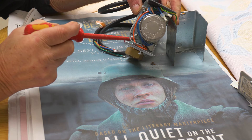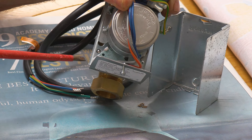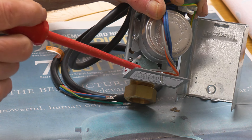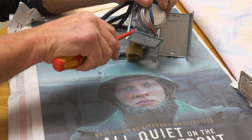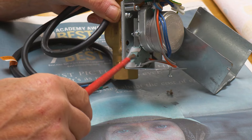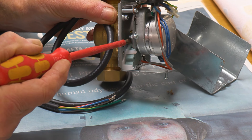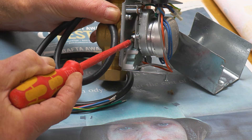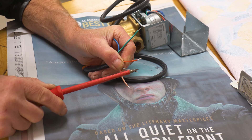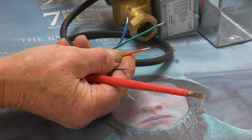I had a look at a new motorized valve and I've never really noticed this before, but they've put a very substantial plastic body around the micro switch housing, which gives it much better insulation. The terminal is now soldered in very neatly, and all you've got to do to take the micro switch out is flick it back and lift it out. There's also a little test switch at the back. If you put a continuity tester across the orange and gray wires, you'll get continuity when that switch is switching and lose continuity when it's not — a great way of testing it with the electricity off.